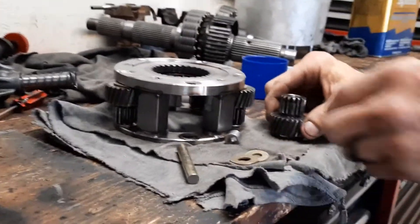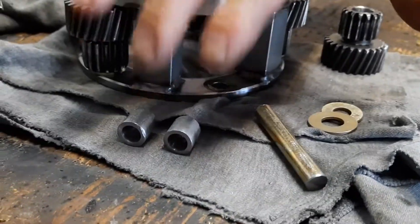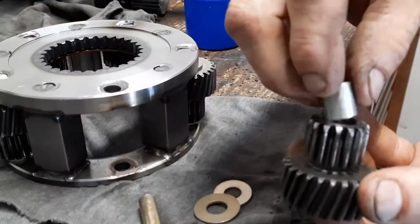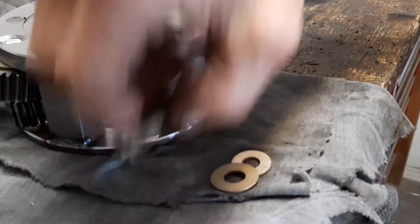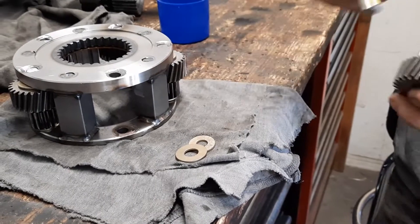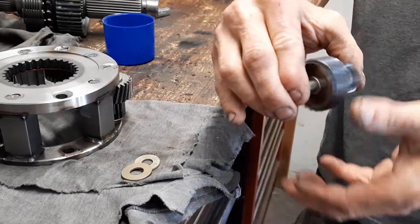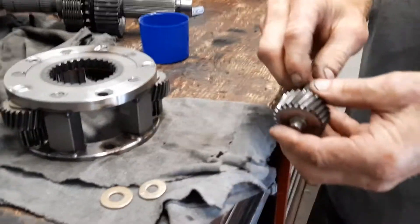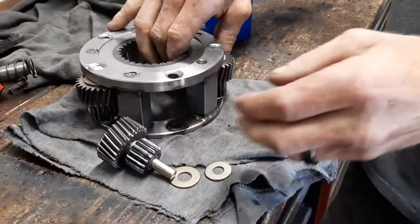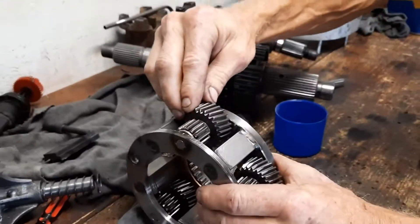Here's what I've got so far. I took the quarter-inch pipe and made these little spacers — they go right in there nicely. Then this is the Grade 8 three-eighths bolt with the threads and head cut off — goes in there giving a nice tight fit. And the Grade 8 washers will take the place of the spacers. I've got all of them in except one I kept out to show you, and everything spins really nicely and tight in there.